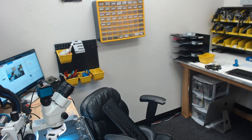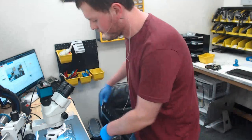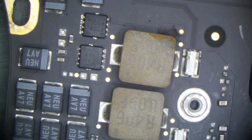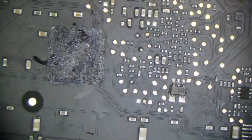Okay, now you guys remember how nasty this board looked before ultrasonic. And now we'll look at it after ultrasonic. There's some water left, so if you see something that looks like flux, it's water. That's all water. Again, water, a little bit of flux residue. Yeah, that's RMA223. It stays on, that's harmless though. Then this area that we reworked looks nice and clean now. We'll get the sticker out of here. So yeah, this board is fixed.